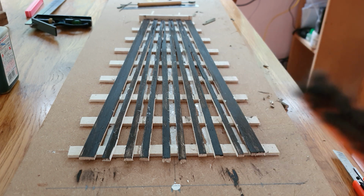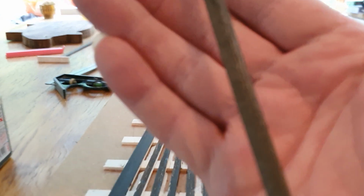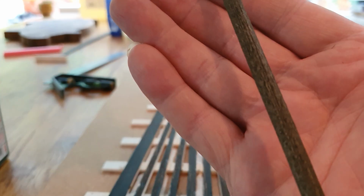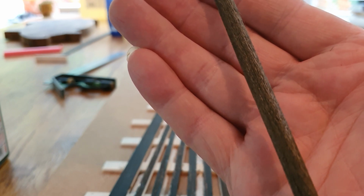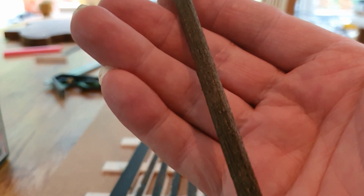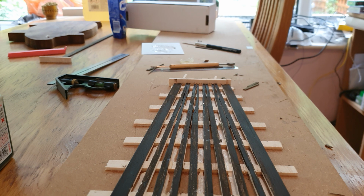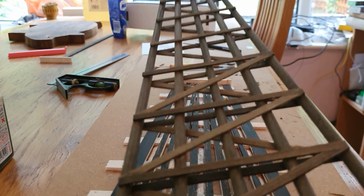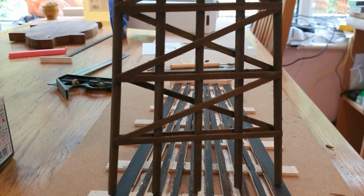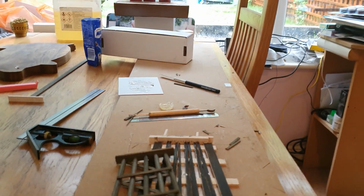And what we've done is we've grained the wood with a metal brush. Now this scars it and puts a texture to the wood, and if I show you, so you can see the different textures of the wood. It's losing focus. You can see the marks it's put in, and then we've rubbed 3 different oil colours in at different places and then rubbed it all together, and then we finish with this colour and texture. And if I show you one trestle which is not fully done, that's not got the top cross members on, but the cross members are there. And if I take it off the stand now, you'll see it.